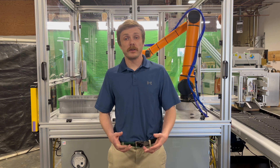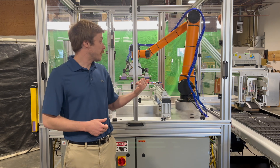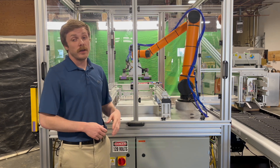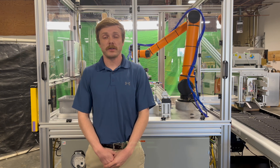I2I Engineering would like to introduce our Material Tote Handling System. The system is designed to take product off a production line to be stored into totes, or to take product stored in totes and reintroduce it to the production line. This system utilizes a collaborative robot, electric actuator, conveyor, and a variety of sensors. All products are integrated using a compact Logix processor.